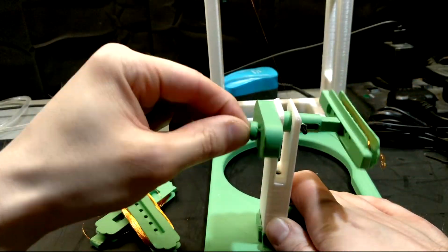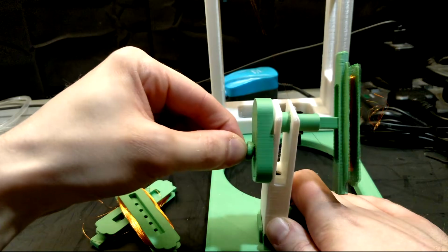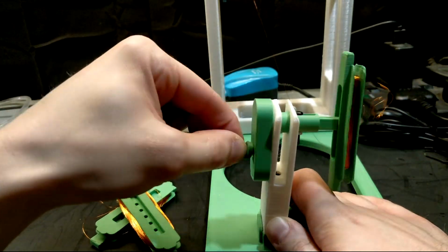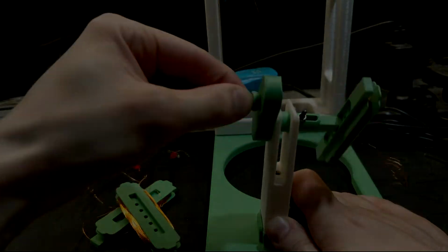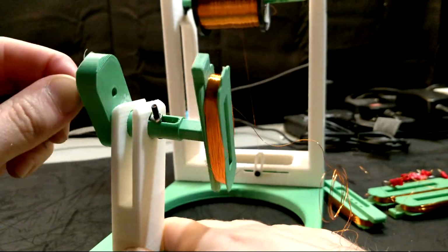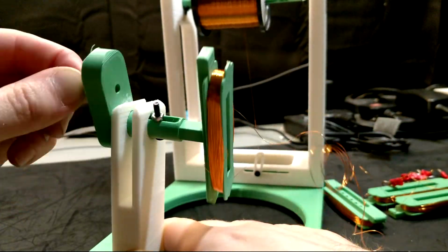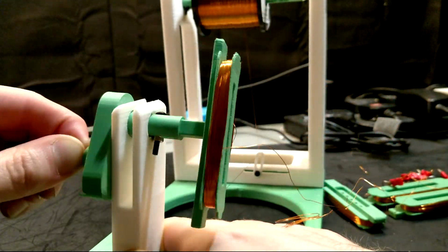This is going to take a while, so I'll use some editing magic to speed things along a little. In total, I am winding 6 coils here, each with 500 turns of 0.2mm enamelled copper wire. For a first attempt at a 3D print, the ModuCoil winder actually works pretty well. The only major issue I have been facing is maintaining alignment, but this is easily fixable via adjusting the wire guide.